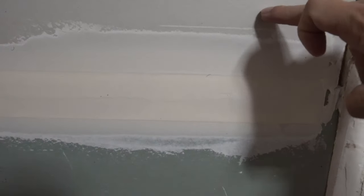That's it for now — we'll come back in about 45 minutes for the second coat. So this is what our first coat looks like after we applied it. The tape is wet, which is what we want. We do have a couple of small ridges, but we're not worried about those because we're going to be putting a second coat that will cover them and come out to about the six-inch line. Depending on how well we do, we may be good at just two coats.